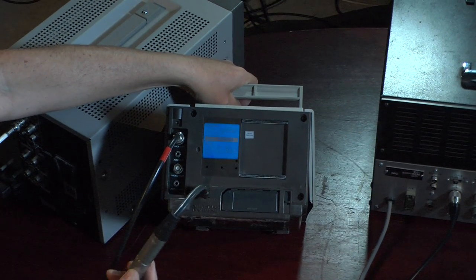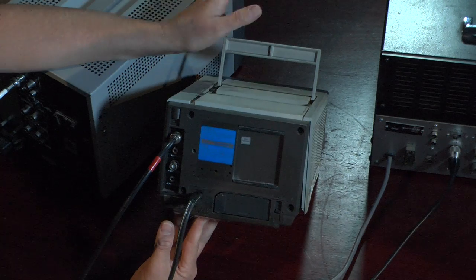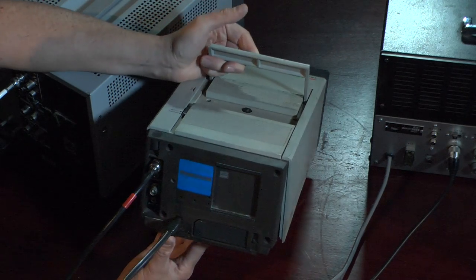We've also got here a five inch screen PVM. This one also ran on an NP1 battery. I've made a lead out of an old BP90 battery so it can run off a 12 volt power supply. It's a monitor only — no RF, just composite video and no other option. This is around the late 80s era. These were good for really portable applications — field monitoring, playing back video off U-Matic or early Betacam recorders. It was just a reference monitor so you could have a look at something in colour, because don't forget the viewfinders were in black and white.